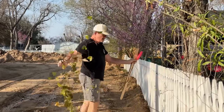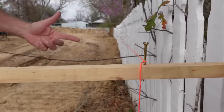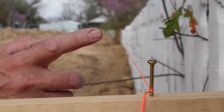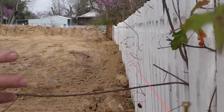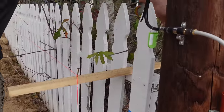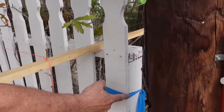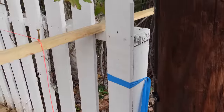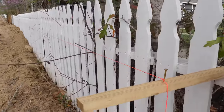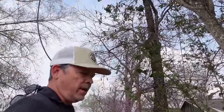Just like that, there is our dry line. We made sure to cut off any twigs or branches in the way so it's dead straight, because it's our reference. It's one foot off the property line. On the survey, the back side of the top rail of this picket fence post is the property line — you can even see the surveyor's tape right here indicating the same, plus a stake showing exactly where the property line is. Let's lay out the building.